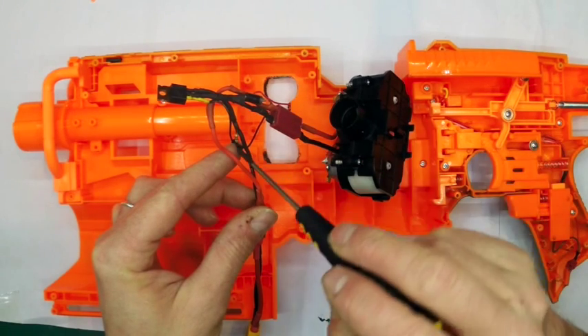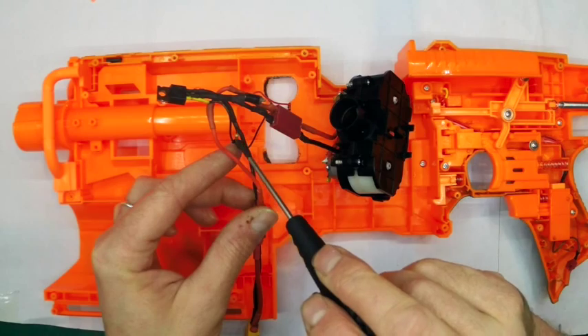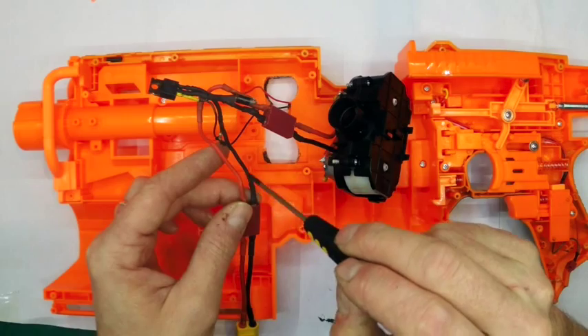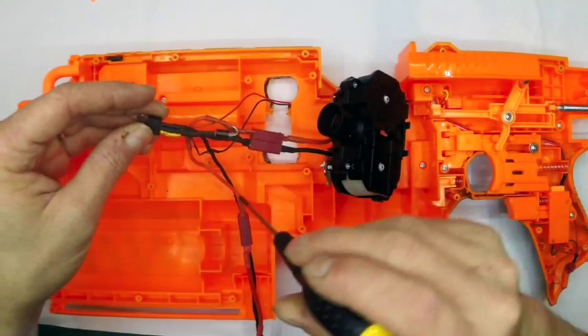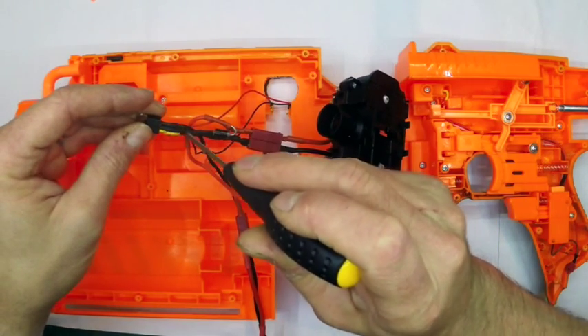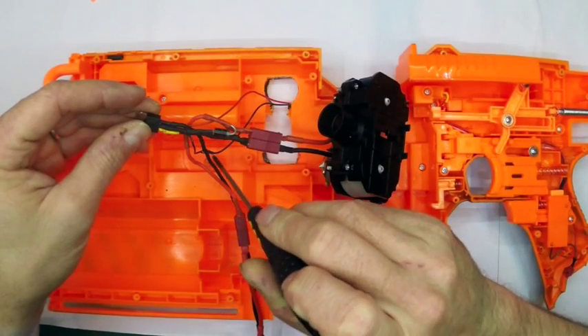Just add a little branch off this wire from your trigger — 10k resistor in here and then back to the ground, which is the ground from the battery. You can see that's the main power feed from the battery. That conveniently brings us to the next connection on the MOSFET, which is the negative feed from the battery. That goes on to pin number three, which is the source — so negative from the battery into this side.